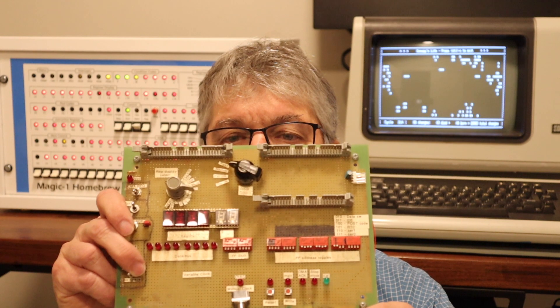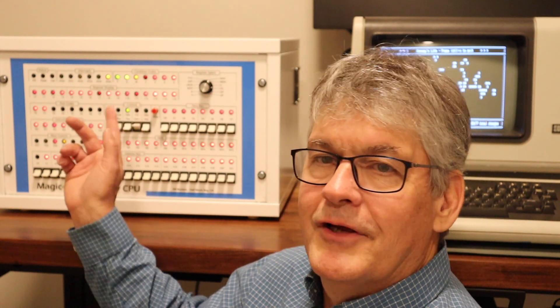Back in 2004, when I did my original bring-up of MagicOne, that involved burning an EEPROM with a simple Fibonacci function. I used a little front panel mock-up to run the program single-stepped with a slow clock to cycle through the instructions until the correct answer showed up in register A. I recorded that original bring-up attempt and I'll put a link in the description below. For this Hello World experience, let's forget the VT100 and Minix and go back to the bare bones. We'll toggle in the program on the front panel and see the results come out on the front panel display.